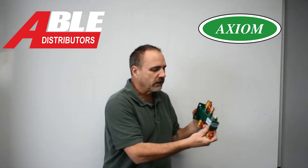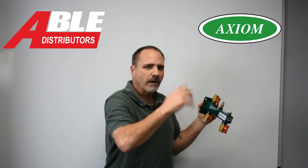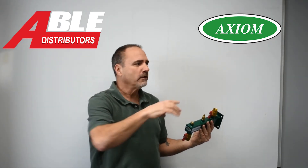This will clean up the job quite a bit between the boiler and this. Not having straps and worrying about if that expansion tank ever fails and fills with water — what are you going to do? Is what you're building strong enough to support an expansion tank full of water? This will make the job look nice and make it go faster. Because literally nowadays, in 15 minutes, you should be able to have that boiler and the support strap mounted and the boiler hung.